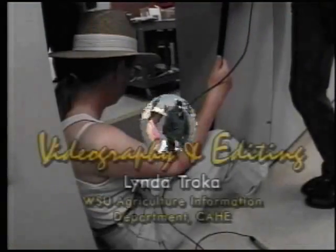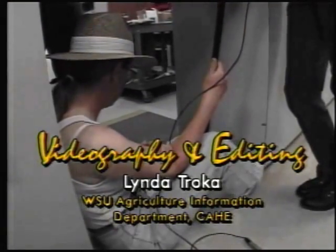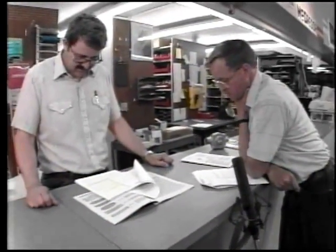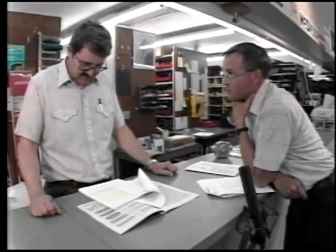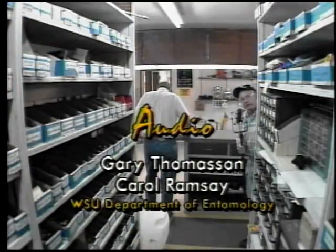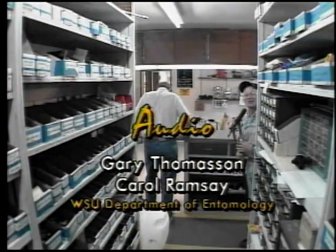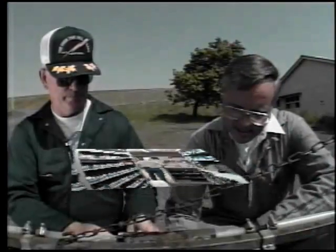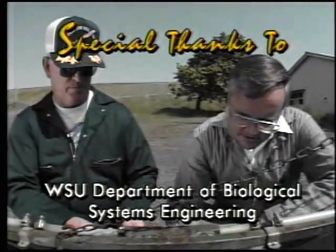What pressure does this first one correspond with? Boy, that shows 60 psi. That's pretty high pressure. We're going to get a lot of drift with that, aren't we? Hey, you want this thing aimed at him? I was going to sit here and give you a little play-by-play. These material screens. Make sure that the tips aren't worn.